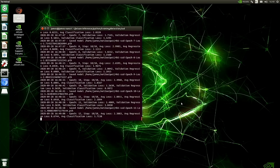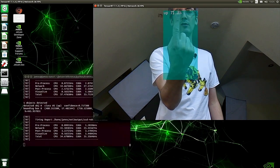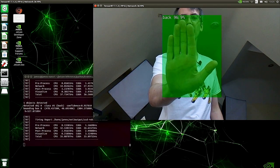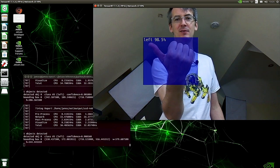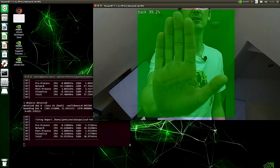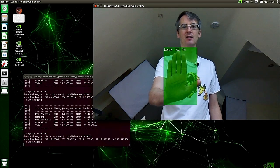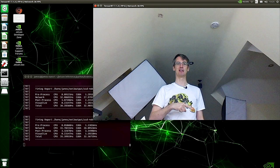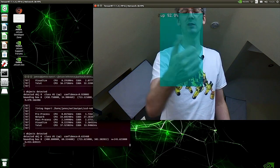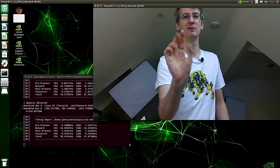We could do with more images and different backgrounds, different clothing, and different skin tones for general public use, but for me it's going to work okay. We retrained the model and using transfer learning that only took about 20 minutes. The model works pretty well: that's up, that's towards me so the robot goes forward, that's the robot going away, that's right, and that's left. We can also check the size of detections in the console to stop people pranking from the background at events. On the whole the gesture recognition seems pretty reliable, though there are still a few occasional glitches.